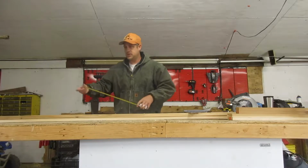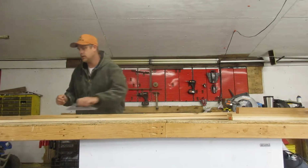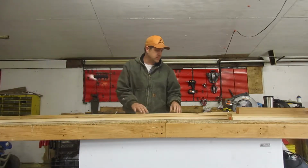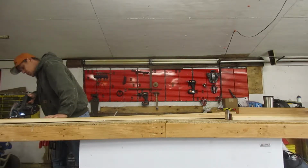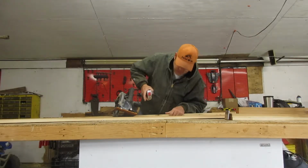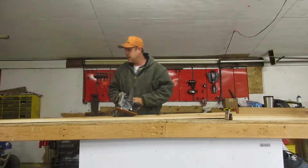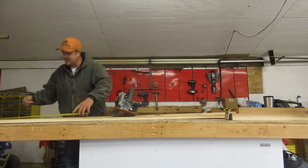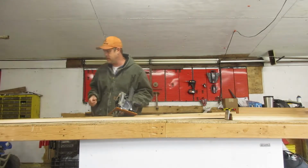And we're going to measure 14 inches. I really wish I had my chop saw. We're just going to do the best we can here. Oh, actually, I'm going to make it, how wide are these boards? 3/4 of an inch? It's pretty close. So I'm going to make it 16 inches wide, that way it'll cover the ends, and I'll have a 14-inch gap for the bats to live in. That's probably why there's a red mark on this tape measure at 16, because that's how big you're supposed to make your bat houses.